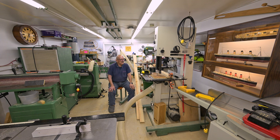Okay, now I got a little bit of a problem in that I have not used my big bandsaw since before the Bismarck. So that's like 4 years ago. And I have recollection of the last time I used it, I had a little short piece that I was trying to put through, and the little plastic insert that goes in the bottom right here, it sort of gave way a little bit, and I got a catch, and I think I bent one of the teeth on this blade, because it kind of hammers as the blade goes through. That's what I recall. So that's why I've got this thing in here, and the plastic insert, it just shattered.